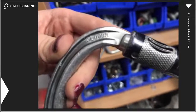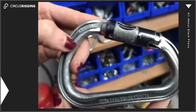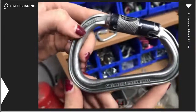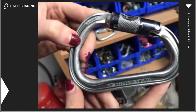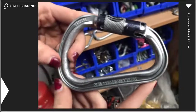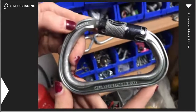But you've got a few little dents and biffs on there. What you do in that situation, that's it, you found it with your nail, fantastic. So now you thought, ooh, I'm not sure about that. So you go to Petzl's website or the documentation that came with it, and they'll tell you that if that groove is more than a millimeter deep, that's the end of life.